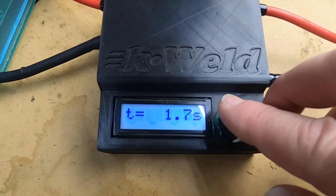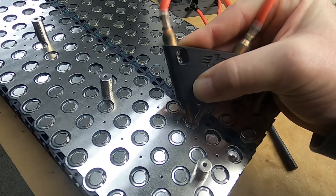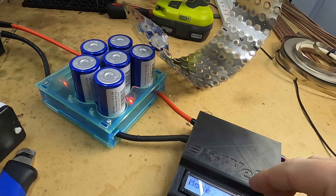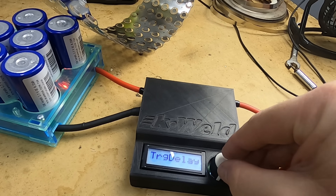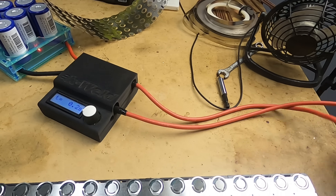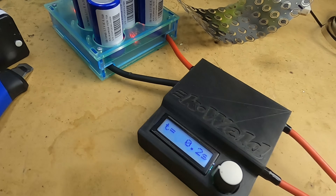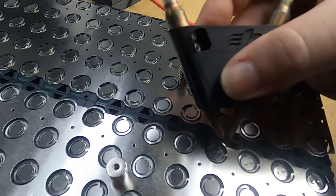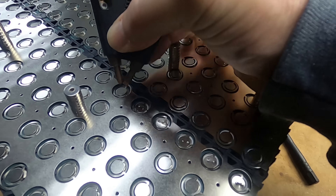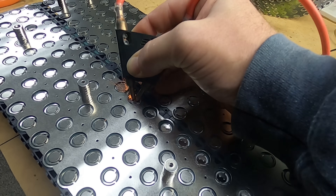When you're in this mode, you can hold it down a little bit longer, get it prepared, and then it spot welds. If you set the trigger delay down to 0.2 of a second, you've got no time at all — you've got to get it on and it spot welds straight away. But doing it this way does allow you to rip out the spot welds quite quickly.